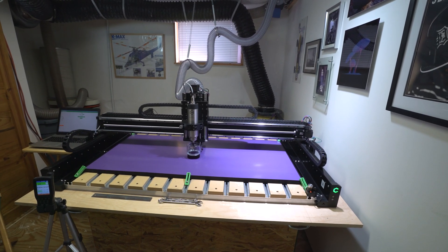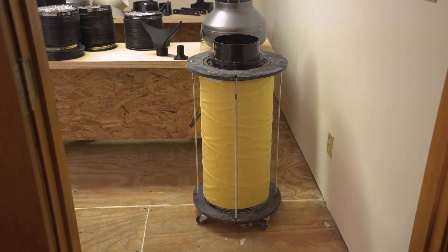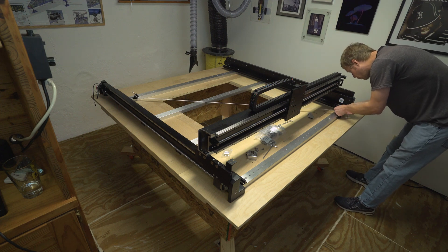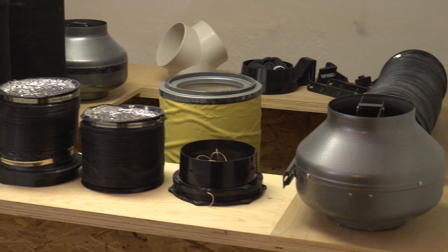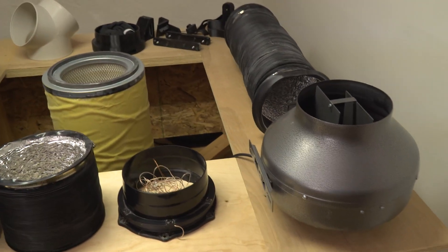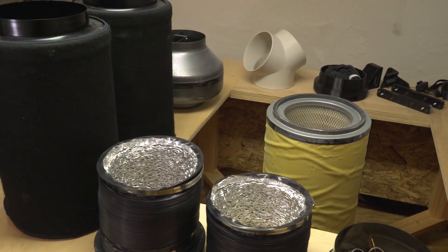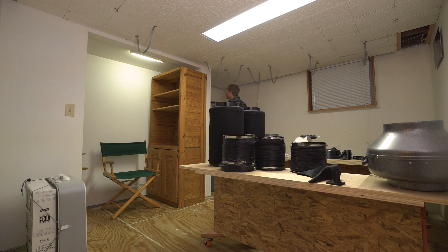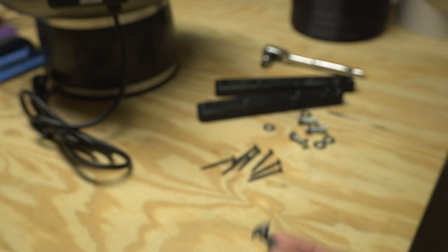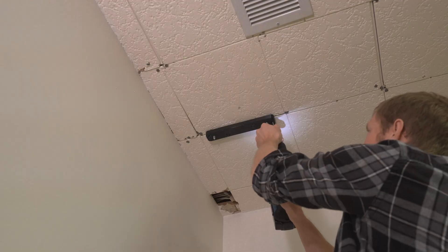Now for a more complex setup. Because I don't have much space in this room, I am going with the Model E cartridge filter and 8-inch inline fans. The filter must be as out of the way as possible. Quite a few parts go into this dust collection system: two fans, a splitter for three ducts, a diffuser, slip ring, and two large activated charcoal filters. To start, figure out where the fans go. The ceiling in here is less than 7 feet, and the fans hang down below head height. To mount these budget fans, I made an adapter that bolts onto the fan from one side and screws into the ceiling from the other.